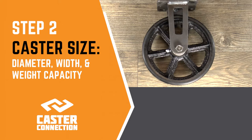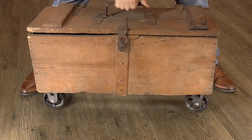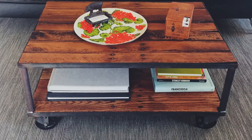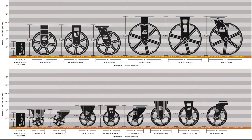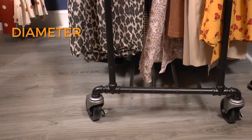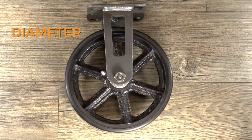When you know which wheel tread you're going with, you need to get the proper size of caster. First, consider the overall height and size of your project and choose a caster that matches the proportions of your project. Wheel diameters range in size from 3 to 8 inches, but your caster's overall height will normally be at least an inch taller than this with the rig and fork. Also keep in mind that all things being equal, a larger diameter wheel tends to move easier.